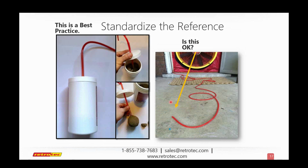In Europe, the maximum pressure that you can test at is 100. The minimum pressure you can test at is 10. And so people think they're supposed to go from 10 to 100. They're not. They're not supposed to go below 10, which means you don't have to go to 10. And you're not supposed to go above 100. Most of the results you're looking for there are at 50 pascals. You'd probably get better results if you tested from 40 to 60 pascals than going over that wide range.